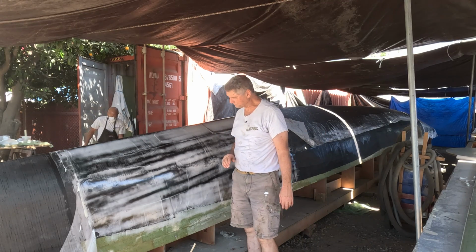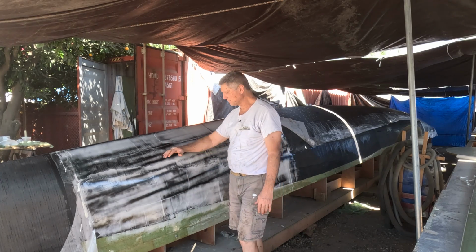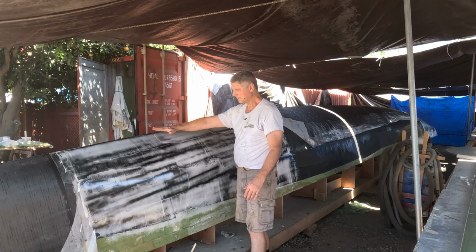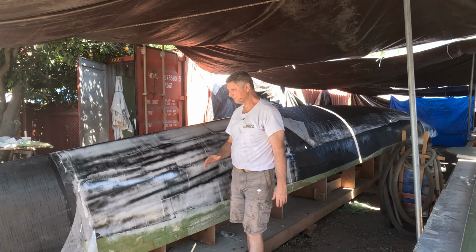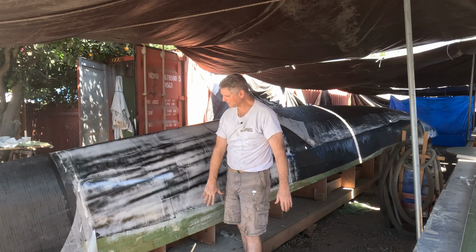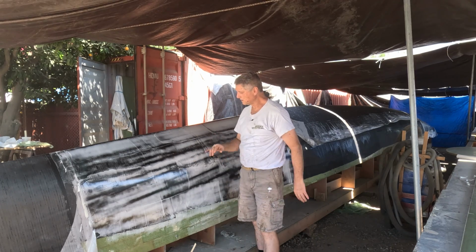So many rounds. Now the goal in fairing this, according to Schoening, is not to coat this whole hull with a thick amount of fairing compound. That's why you still see the hull, the black from the basalt, showing through in a lot of places. We want the thinnest coat of fairing compound necessary to get this to a smooth surface. Not coating the whole thing with a lot, because that just adds weight to the boat. And frankly, fairing compound is not as strong as the basalt anyway. So we don't really want a heavy layer of fairing compound. We just want as light as we can to fill all the low spots in here. And this is obviously not enough. We will sand and put more on, but still we want to keep it to the thinnest coat possible, which was our goal.